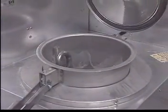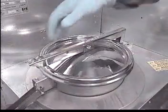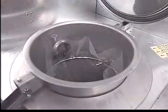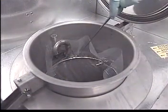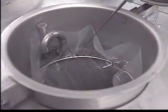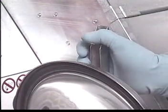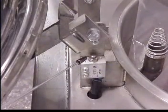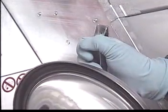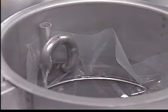Always close the lid to prevent evaporation into the environment. The distiller has a safety design that prevents pumping of solvent from the gun washer without the distillation lid being open, allowing the operator to see how much solvent is being filled into the chamber. Do not fill the chamber past the retaining ring. On the 3-gallon unit, the operator activates the pump by pressing the switch located on the door lid. On the 6-gallon unit, the operator activates the pump by pressing the switch adjacent to the door hinge. Dirty solvent is pumped from the gun washer to the distiller. Never fill the distiller above the retaining ring.